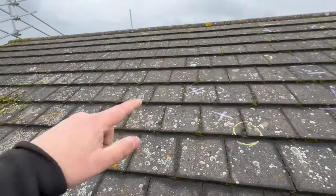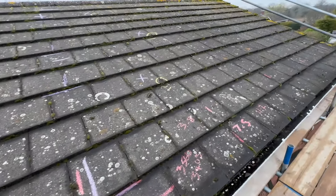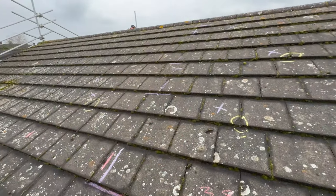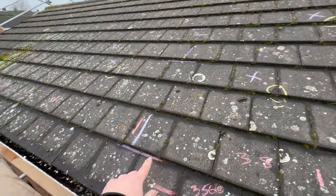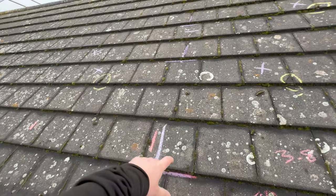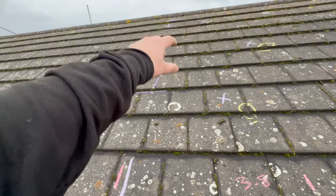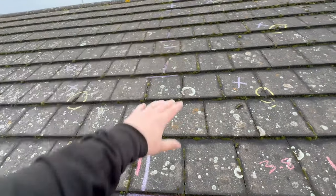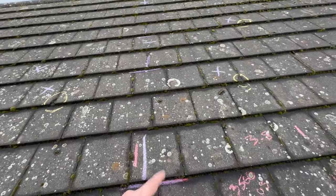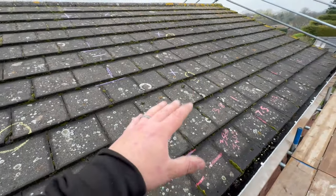The other side of the roof was setting out slightly differently — I'll take you over there and show you in a minute. So we're going to have two rows in portrait, seven on the bottom, eight on the top. These are our hook lines here — we'll end up being about 250mm from the hook on the bottom, and at the top we're 400mm down from the first clamp on the panel, and the mid two are set about right. It's just where the array shuffles up and down — you try and get them as close to ideal as you can, it just affects the wind loading.